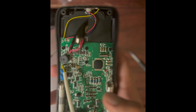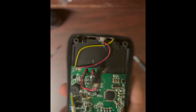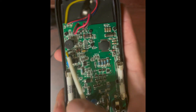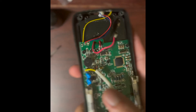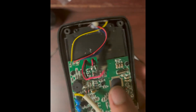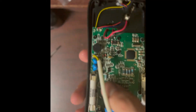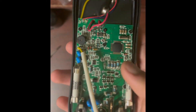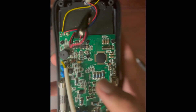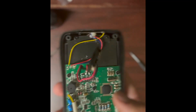There are also diodes here for AC rectification. On DC it's no problem — the chipset reads DC voltage directly. But AC would fry the chip, so a diode rectifies the AC into DC before the chipset reads it. That's the basic concept: the diode turns AC into DC so the chipset can read it.